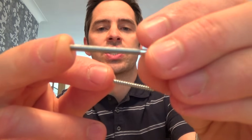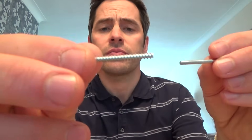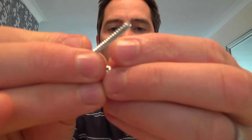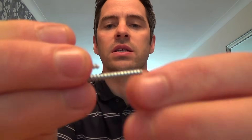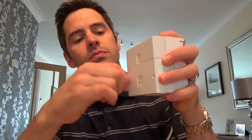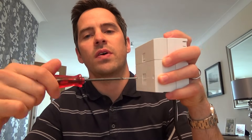The machine thread ones are the same as you would have on older master sockets and on electrical back boxes. This one here is a self-tapper, so just match up the little screw that came out — you can see it's not like the machine screw, it's like the self-tapper. In this instance you just use the self-tapper. Screw in your self-tappers using a Phillips screwdriver, use both of them, and that's how you fit a VDSL faceplate.